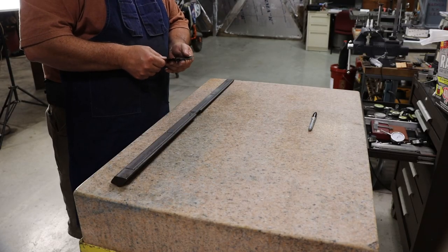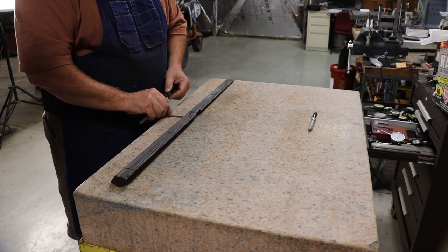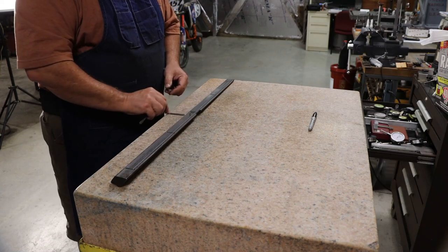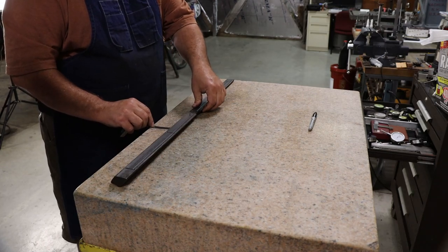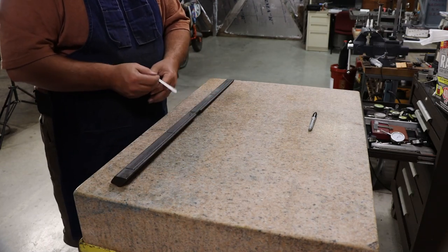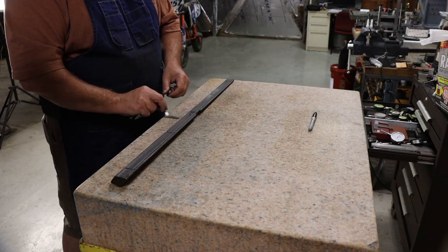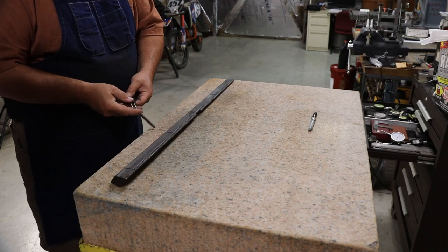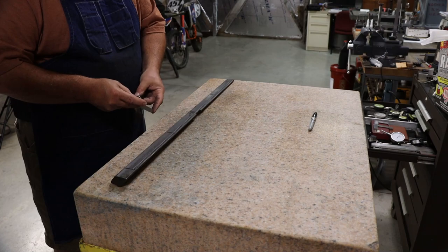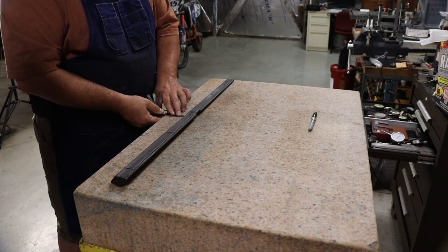We'll take that, that's a 9 thousandths. And it's touching now. Yeah. Okay. We moved it, yeah. So I can't get it all the way through there. It's coming through the front, which this thing's sitting a little bit crooked. But so let's go down. Let's see, here's our 1.5 thou. Okay, it's still in there good. Let's go somewhere about halfway in between. Here's a 3 thou.